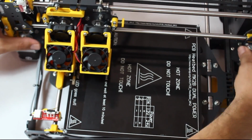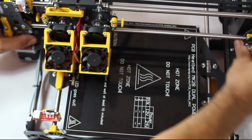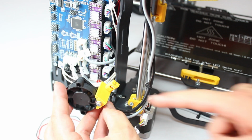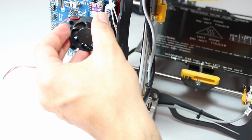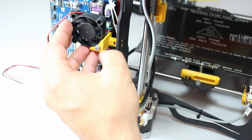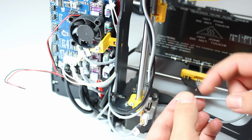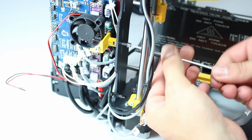To apply the fans you might need to move the X-axis. Rotate the flex couplings to do this. Remember, the couplings must always rotate simultaneously. Apply each fan by threading a screw through the frame at the points shown. You may have to brush aside some wiring for the fans to fit, which is why you had to leave some slack in the cables earlier.